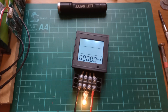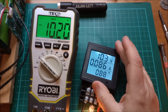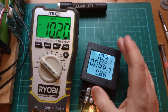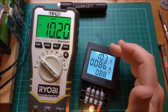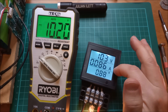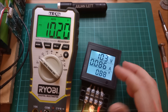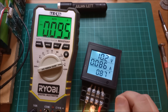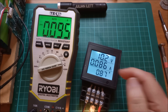One thing this doesn't have is any means to calibrate it — unless there's a pot or something, but I think the board's going to have to come out for that. It does appear to be a little bit out: this is reading 10.3, this is 10.2. When I was watching a varying voltage, I could see this was actually about 150 millivolts out. So that means the watts calculation is out as well. The three-digit current measurement — I'm not entirely sure how accurate that is either. My meter says 0.095, 95 milliamps, and this is saying 86 milliamps.